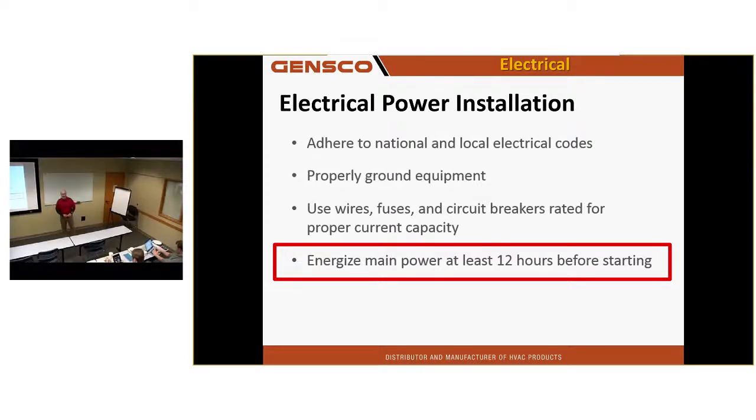As soon as you turn it on, you create a pressure differential, and any liquid refrigerant comes out of solution, turns the oil to foam. I don't have any data to tell me how long you will drain the oil out of my compressor in this inverter-driven system, but I know in a hard start 60 Hertz system, it only takes 3 seconds to drain every ounce of oil out of the compressor on a flooded start.